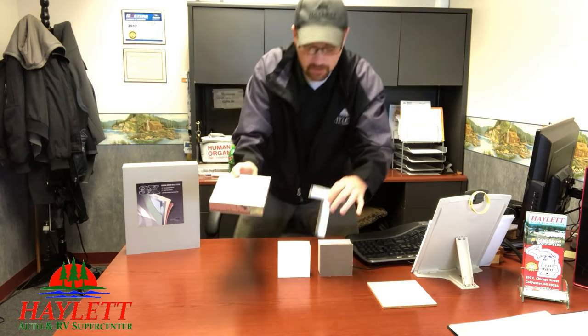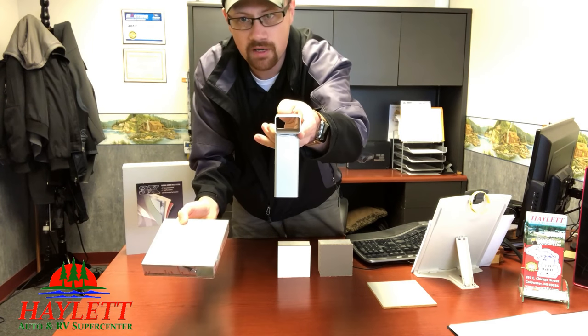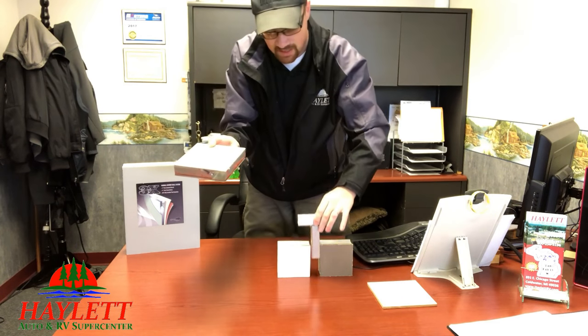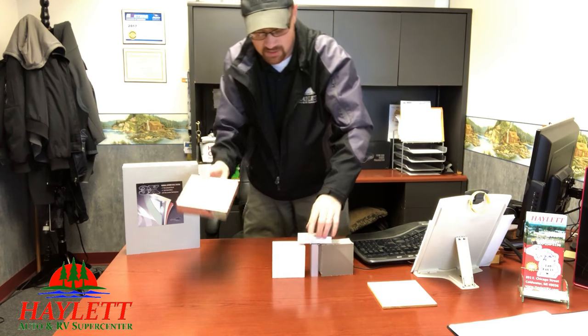If you want to go from a standard two-inch wall to an inch and a half ultralight wall, a lot of people ask if there's enough structure to it. This is probably my favorite sample. You've got an inch and a half by one inch tube structure here, and you have the same thing on the other. All they do is take the stud and turn it so that it's now the same amount of structure — just turned slightly to keep the total wall thickness down. That saves a little weight on all the bead foam packed in, and everything adds up.